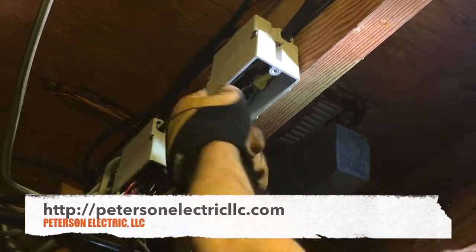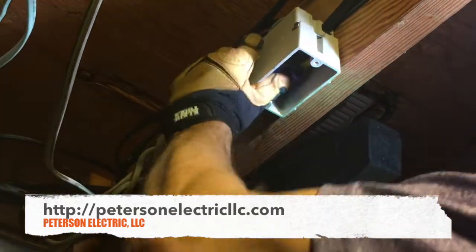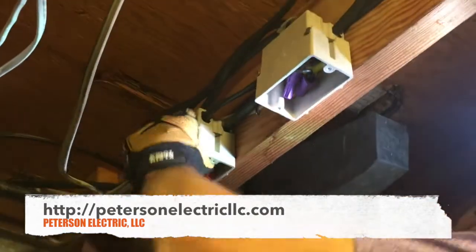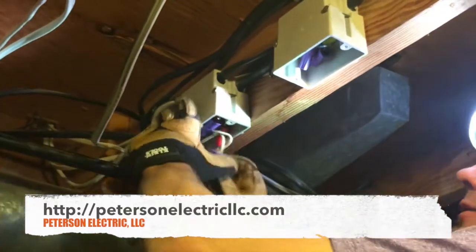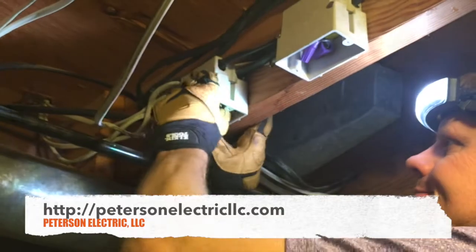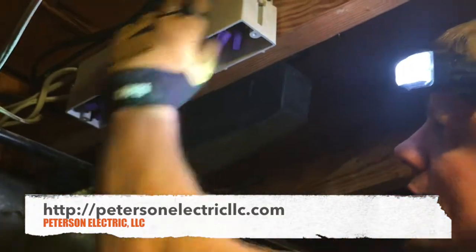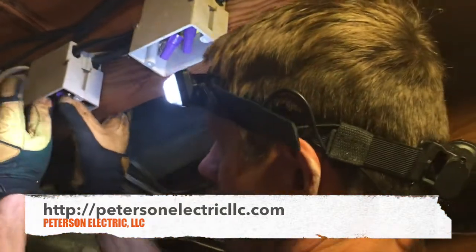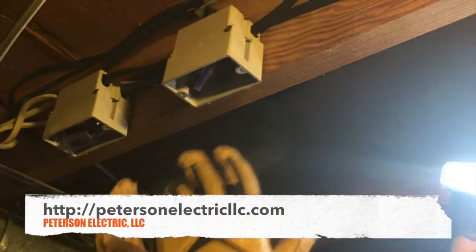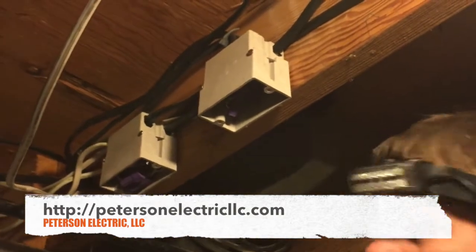This is the proper way to do it — this stuff was just hanging out, so we'll go ahead and junction it. I think she told me circuit 23 and whatever the other one was. Try to keep your caps in the up position if you can, so they don't drain out. That's probably one of the reasons I don't care for those caps as much — over time, especially in an attic, the deox will drain out of the cap. Think of it like a coffee cup.